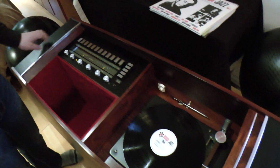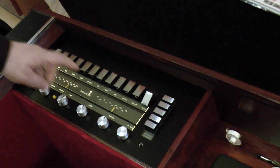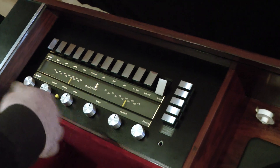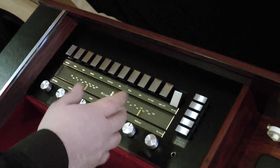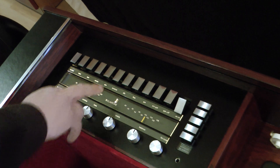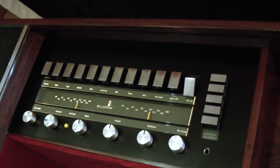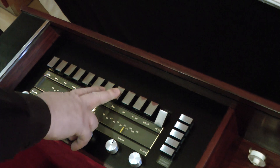Let's start with the amp. Button-wise, we have AC — that's to turn it on. Speaker off is to turn the speakers off if you ever wanted to hear with headphones and not have the speakers on. External speakers not used — that would be for a different system. AM reception would be surprising; you may get some, but with everything in the airwaves now, FM is very hard to pick up. Here's the FM button. AFC is what we always use in concert with the FM button, just to make the air band tighter so there's less interference between channels. Those two are always nice to use together.